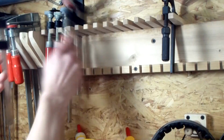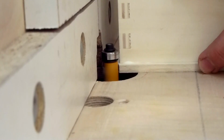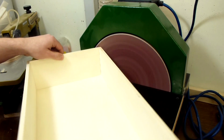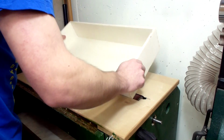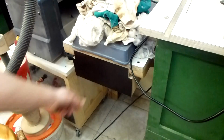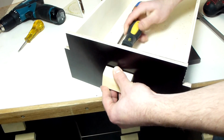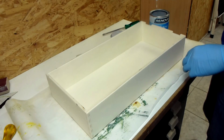And the clamps go back into their home. I made the bottom a little bit oversized and flush trimmed it. And also rounded over all the edges. Seems to fit. Here with the drawer front attached. It needed some cutouts to not interfere with the brackets. Then attaching the handle. And finally wiping on 2 coats of varnish.